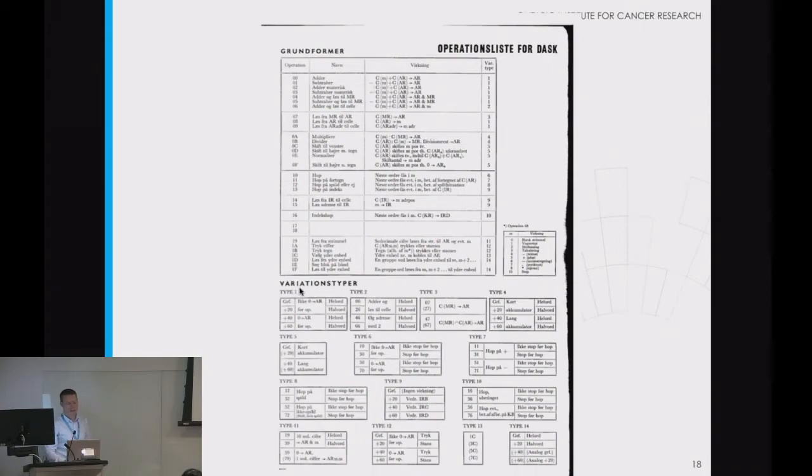And down here you can see the table. Each operation has a modifier type, and this table tells you, depending on what your V20 and V40 were, how they all behave. So this is where you set the accumulator to 0 before doing the addition, or don't change the accumulator register before setting the value. So even though it's a simple instruction set, there's quite a lot of modifications that can happen.